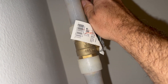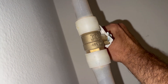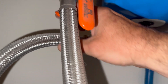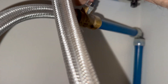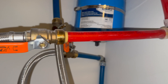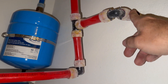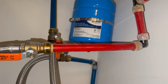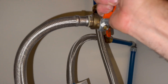Shutting down the main water supply to the apartment because I need to isolate this heat coil so the tenant can still use the water throughout the apartment. Here's the return valve — the blue line behind all these other hoses — I'm going to shut this down and keep it shut down. There's no shut-off I can use just to shut off the heat coil because that hot water also supplies the domestic hot water.